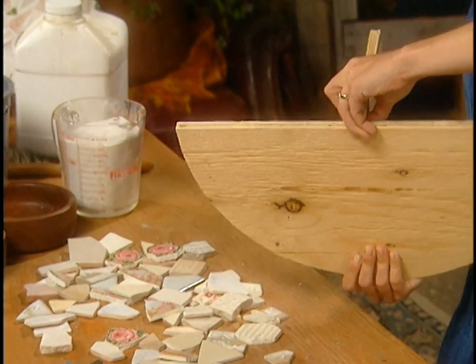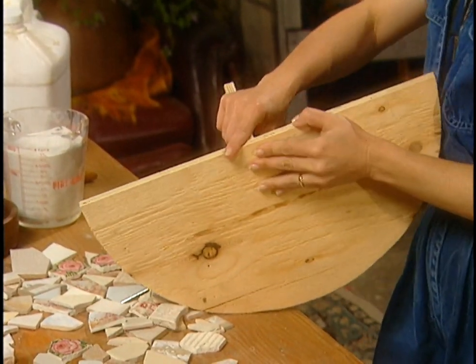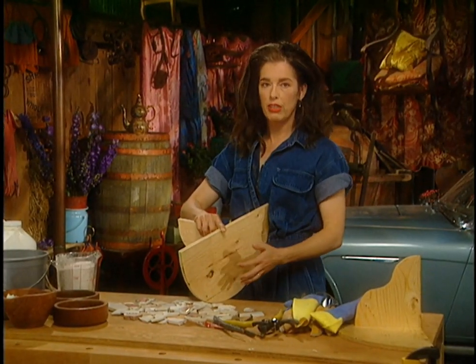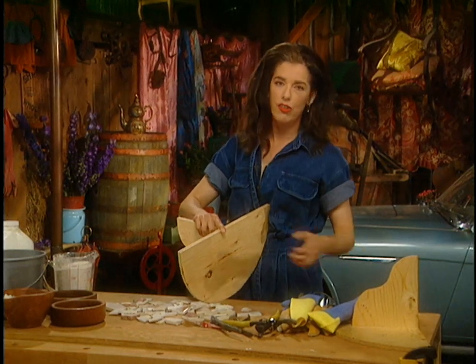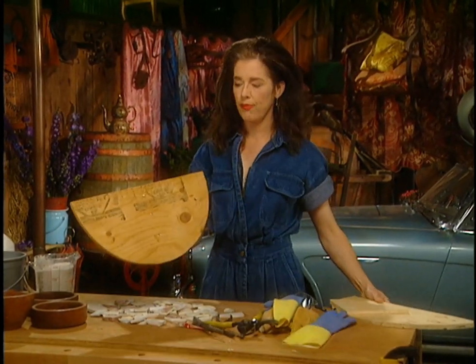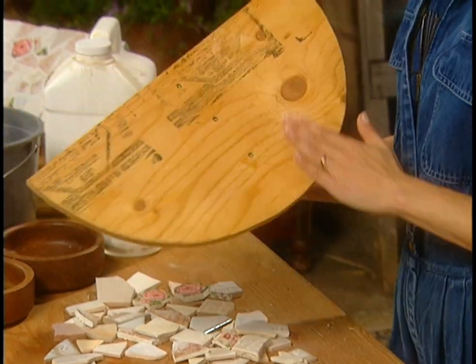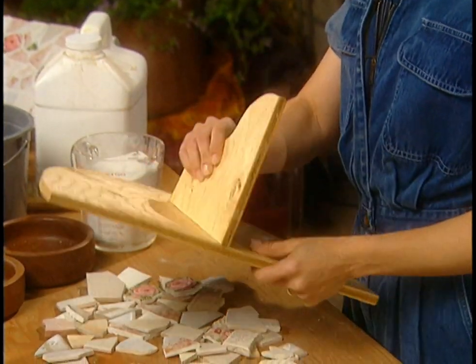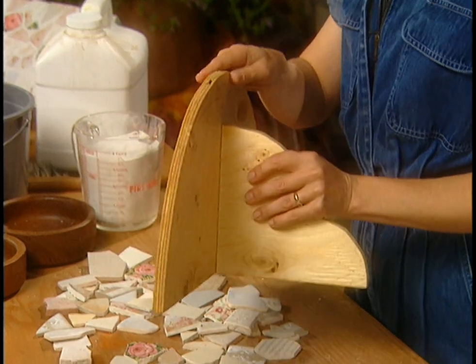To make sure it's not going anywhere, put it on the side like this and put three screws into it. If you're using plywood you'll probably have to pre-drill because the plywood tends to reject the drill bit. You end up with something that looks like this with the screws in it, and you have to seal it with some water-based urethane, otherwise the plywood absorbs water and gets all swollen.